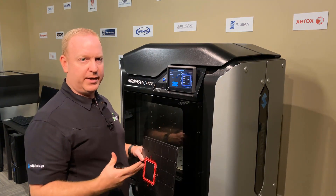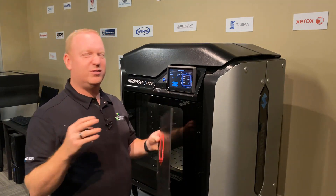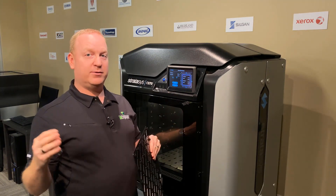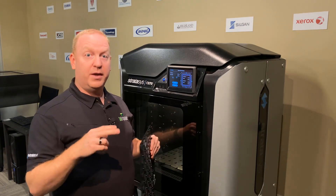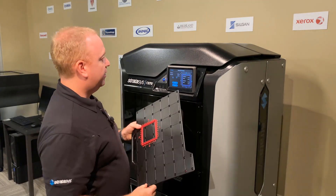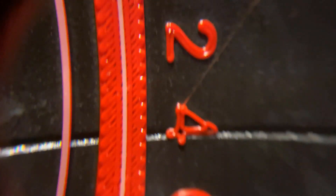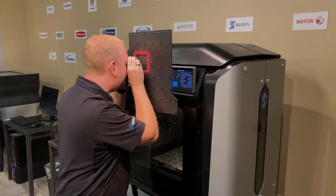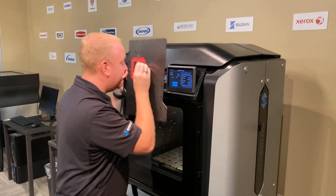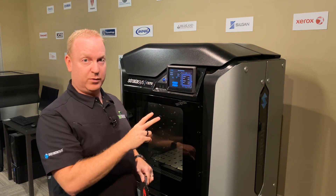Just to refine that print. If you see something and you're like, is it 0, is it 2, is it 1 — we're dealing with 10 thousandths of an inch here. So make your best guess; you're going to be close enough and it will be fine. Double-checking what I'm seeing — in this case, the two Y calibrations are right on 0, which is exactly what we want to see.